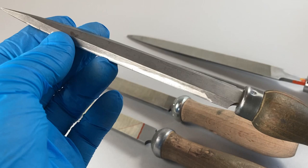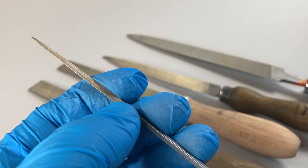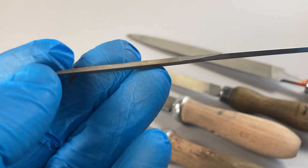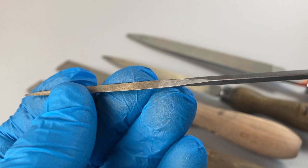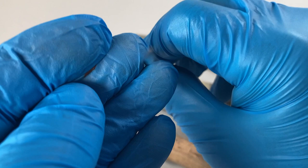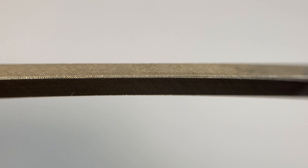This barrette file has a six-inch blade and is number two cut. Next we're on to an escapement file. Many of you may be familiar with a needle file — a needle file and an escapement file are very similar. An escapement file is often used in watches, hence the name. For fine finishing and new-making of watches or other small components, a set of escapement files is absolutely indispensable. This one is triangular in section but it's called a three-square file. When we look at the edge, two of the cut edges intersect with a little bevel — so the same issue applies: you can't file into a corner and get a nice sharp corner.